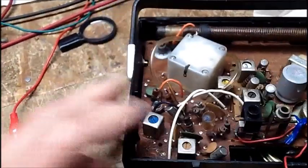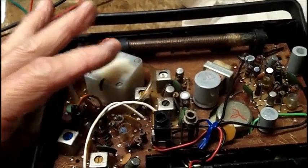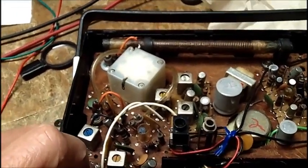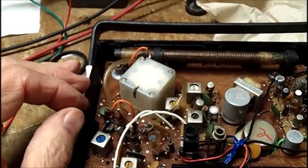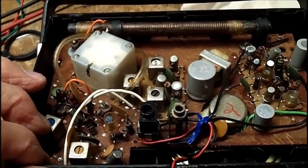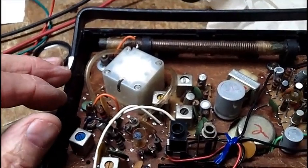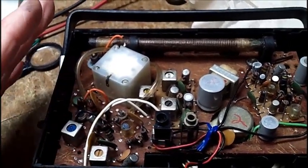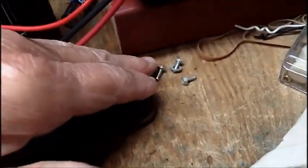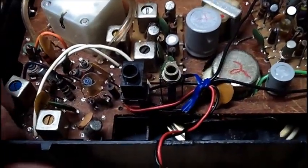What I am going to do is continue with the battery charging and, as Brendan said, leave it on overnight. Maybe it'll form up these capacitors. Judging from his watching my video, the radio appears to be coming back to life the more I use it, but leaving it on a half hour didn't seem to do anything. Maybe overnight it will. It's actually noontime now, so I'm going to leave it on all day today and let the capacitors form up. I'll put these three screws back in and the knob back on — we're not going to pull this out.